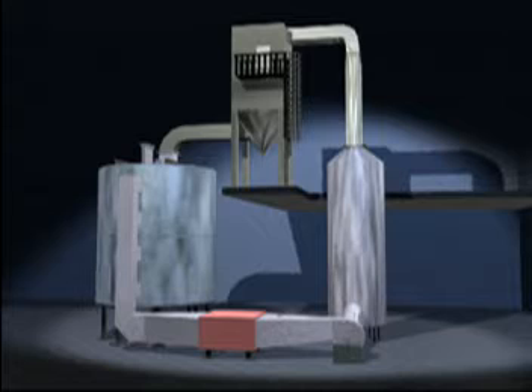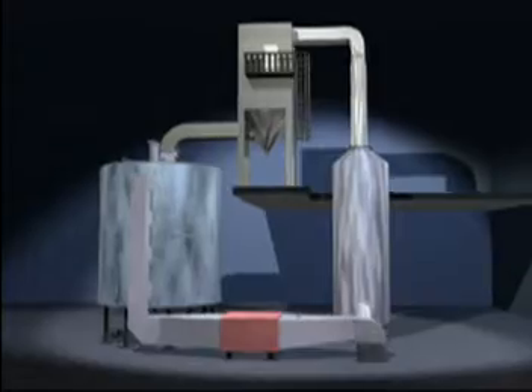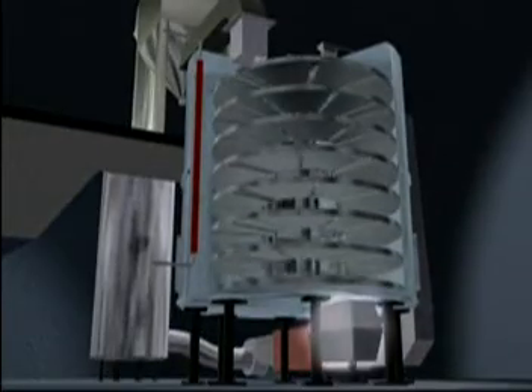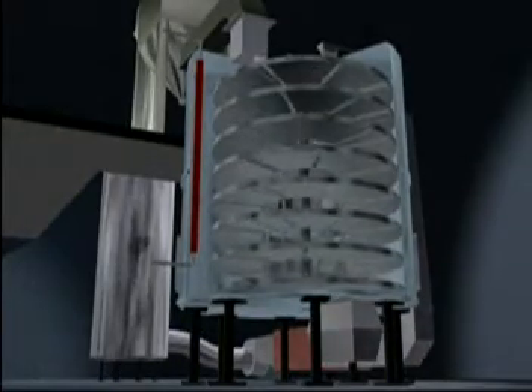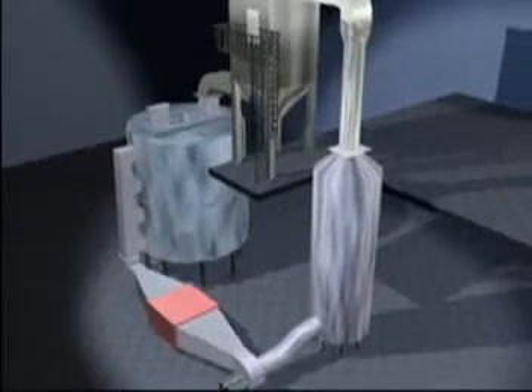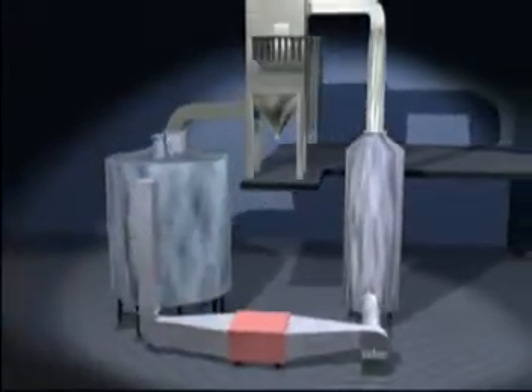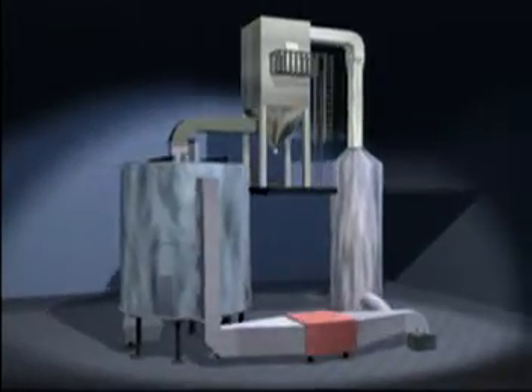In this case, the circuit consists of the dryer, now called a sublimer, a filter, an air-cooled condenser, and a recirculation fan. The recirculating medium is preheated before it re-enters the sublimer and is continually heated inside by internal heaters. The impurities are collected in a container from which they are periodically removed. Continuous turbo sublimer installations, which have replaced old-fashioned batch sublimers, have greatly reduced operating costs and obnoxious conditions.